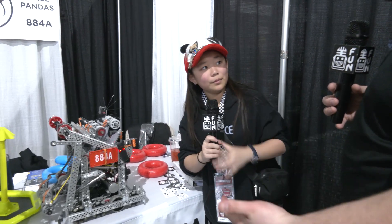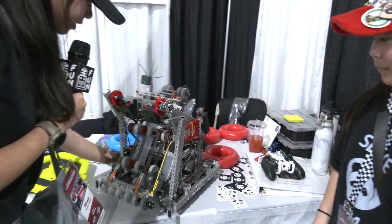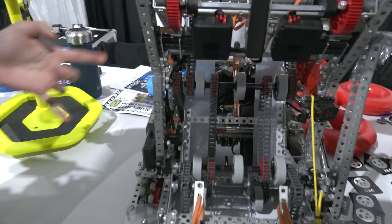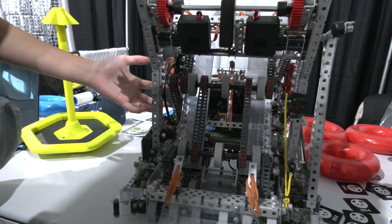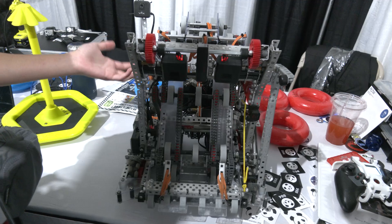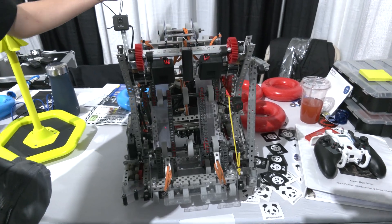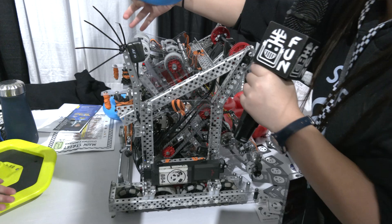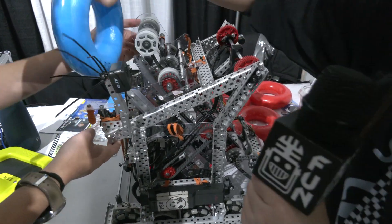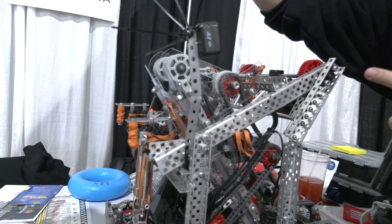You have a bunch of sensors on your robot. We have two optical sensors on our intake ramp for color sorting — we use two for redundancy. When intaking a ring, we detect what color it is. Sometimes there are discrepancies between the two, so we use the data from the top one since it's the most recent. That allows us to decide whether to trigger the color sorter. We can demonstrate: shove an opponent's ring in, and you can see when it hits the optical sensor, that's what extends our ramp. Take it out, and it retracts just like that.